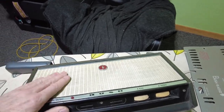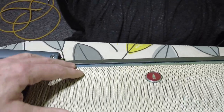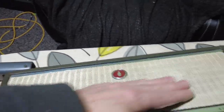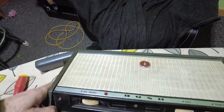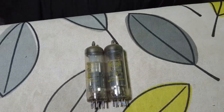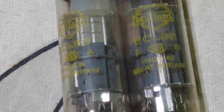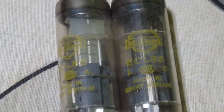The other thing we have to be careful of with these is this faceplate is made of metal and if we don't get that nice and tight it will rattle quite badly. But it's in reasonably good condition — in fact given its age it's probably in exceptional condition. Check those out — a pair of yellow-print Mullard ECL 86s. So as long as they test good on the valve tester, they're excellent.